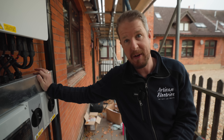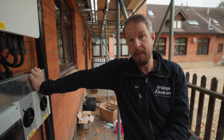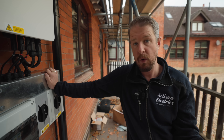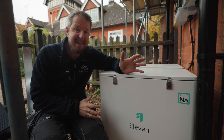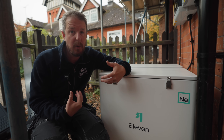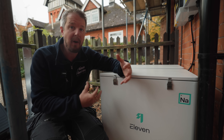One of the first and biggest differences with sodium batteries is the abundance of sodium — it's basically salt, which is found everywhere. It's easier to extract sodium than lithium, uses less water, and is better for the environment. Overall it's a much more plentiful material, which should eventually mean sodium batteries manufactured at large scale will be cheaper than lithium too. The second advantage is that sodium batteries are highly thermally stable — they can operate from minus 20°C all the way up to 55°C, even safer than lithium iron phosphate. And at end of life, they are a lot easier to recycle as well.